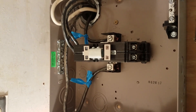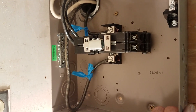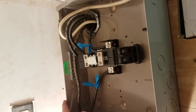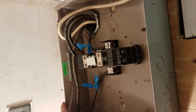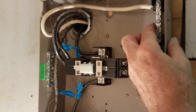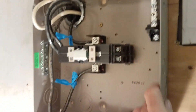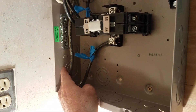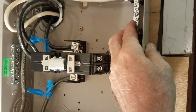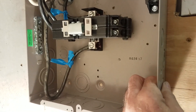The meter is only about two to three feet away from this box; it comes in with two wires here. We haven't dressed this yet. We were thinking about running the generator wires to these two terminals with the neutral on the outside, but we decided to run a neutral inside anyway since we're buttoning this up. So if you want to run conduit from here back out to a different location, you've got the two hots and the neutral, which gives you 110 volts from here to one of these.